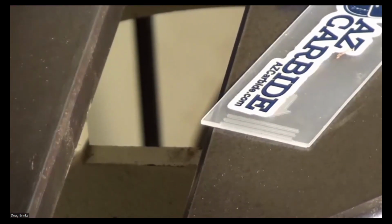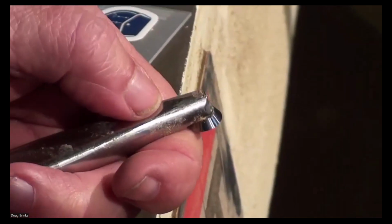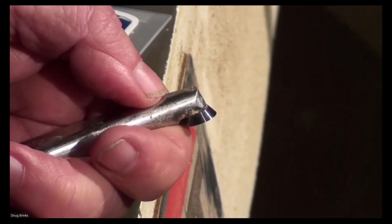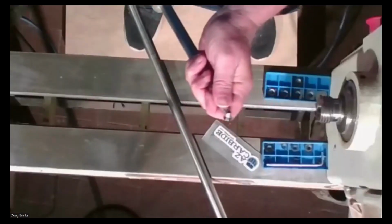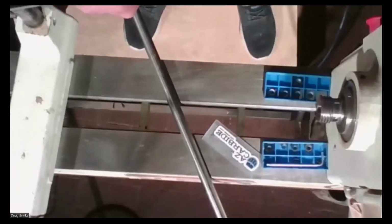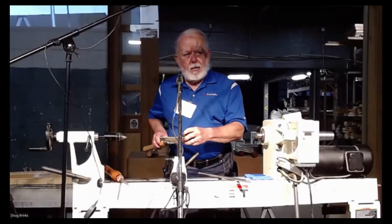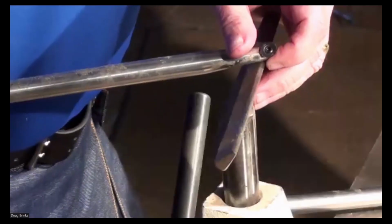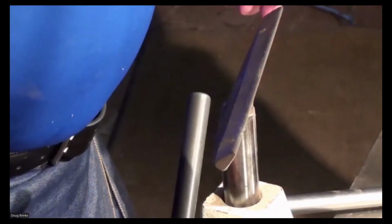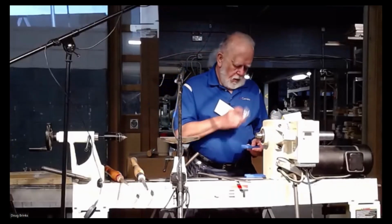So now we want to go to this bar. I wanted it smaller. I wanted to be able to change things up. But when you get this small, and I don't remember, that's probably 4 millimeters, if you get that small, you can't stay flat. So now, Keith's is even worse, okay? When I present my tool to the work, I have to be a little further away because of how small this area is, okay? But it allows me to get down to a 9 millimeter cutter, which is used on many hand hollowing tools. Plus, they're all Torx screws. One screw fits all of these cutters, and I think it's a huge advantage. And we've sold a bunch.